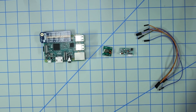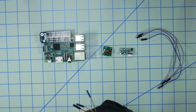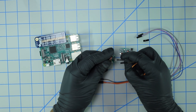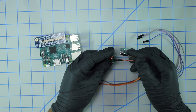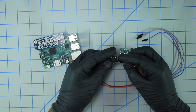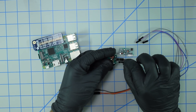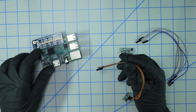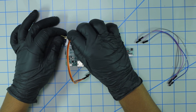The first thing you need to do is hook up the transmitter. I'm going to go ahead and plug this red cable to the VCC pin, which in my case is the middle pin. Then we have ground — I'll just have that be this brown cable here. And finally, the data pin will be this orange cable. The red pin will be hooked up to 5 volts, which is the first pin on the top row.